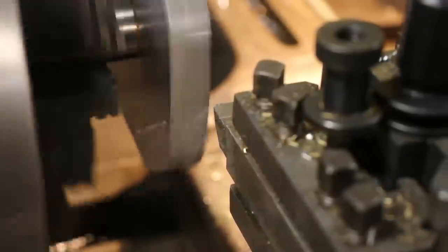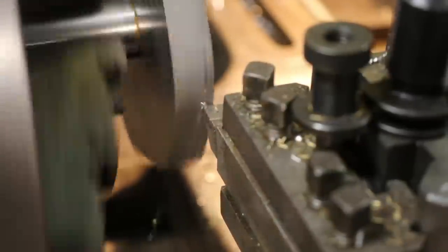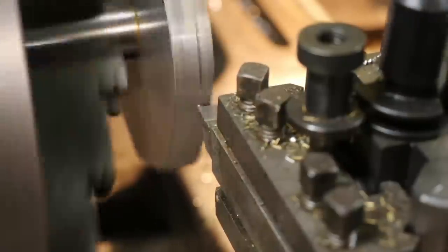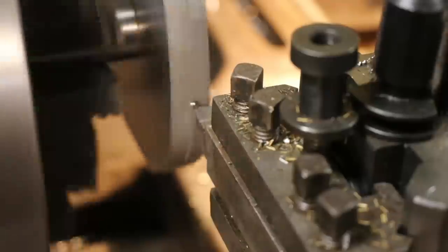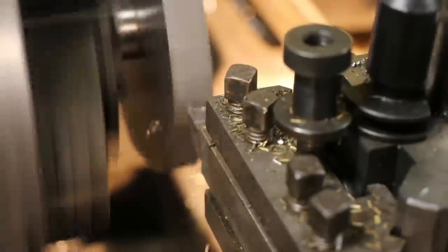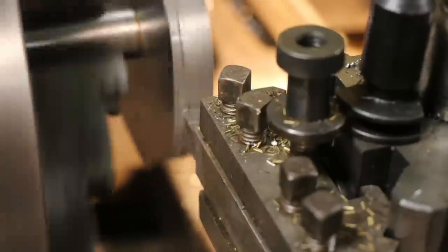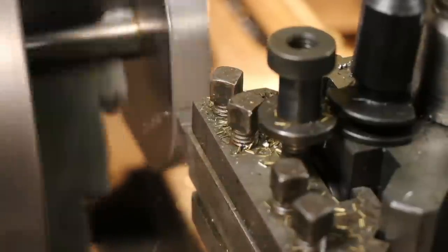Then I know guys that don't have any of it, and they rely solely on insert tooling, individual replaceable inserts. And although those are awesome, if I had to choose, and I did here, whether to use just insert tooling on this interrupted cut or a brazed-on piece, obviously I chose the brazed-on carbide. Simply because it offers the benefits of carbide and the rigidity of a solid tool.